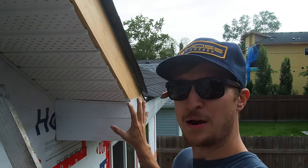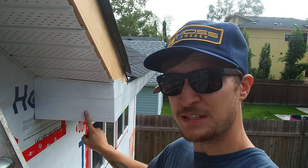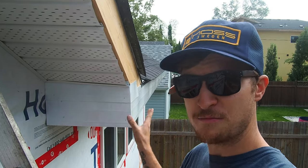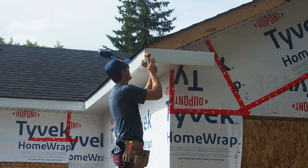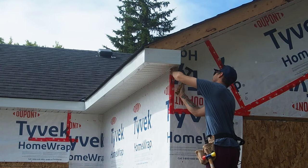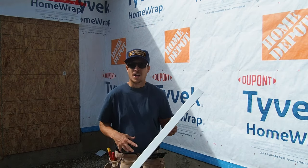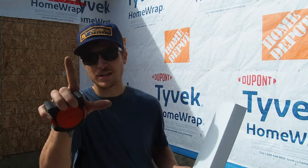On the backside of the garage with one that's already complete, you can see one of the bird boxes a little further along. We haven't done the gable piece of fascia yet because that is the absolute last piece we'll put on. We've put the initial piece of fascia that wraps all the way around the corner, then added this little flashing piece to cover that extra section of the bird box that the normal piece of fascia isn't tall enough to reach. From the other corners, I know I need about 23 inches of flashing to wrap it around enough so that when I do the gable, it'll cover the end of it.